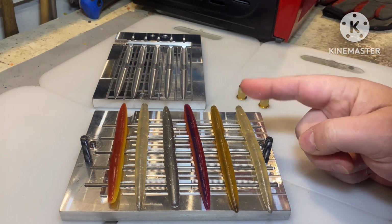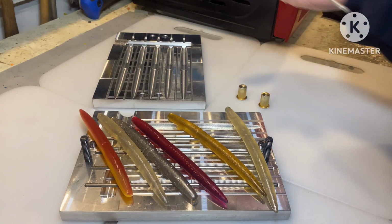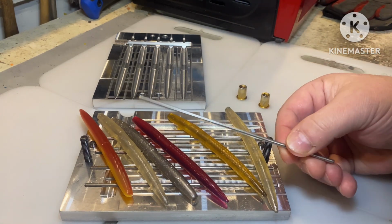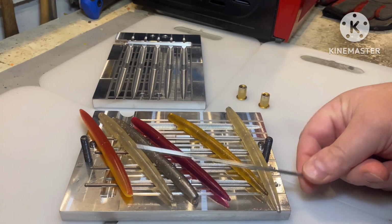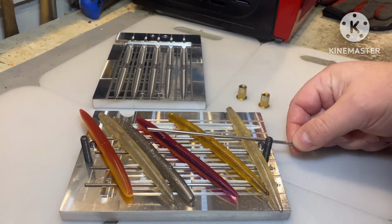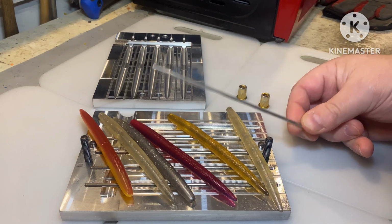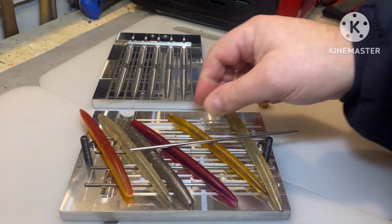I've tried, I mean, I'll run these rods piping hot. I'll run the entire setup hot. I'll run the plastic cool, doing everything right, and it will still dent. It dents, for me, almost half the time. The thing will dent unless I do a perfect shot, 310 degrees, everything's hot as hell, and you hold a lot of pressure. Then, yeah, then you're going to get some core shots out of it.